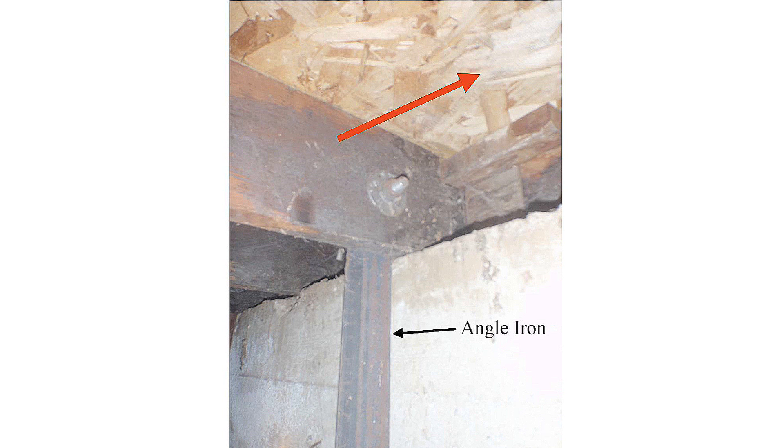This is what happens when the floor joist moves in the other direction. The nut and the washer on the bolt must restrain that movement. However, when that movement is restrained, it puts the floor joist into a condition known as cross-grain bending. Cross-grain bending causes wood to split very easily. Cross-grain bending is such a serious problem that the design manual that structural engineers use when designing retrofits highly discourages its use in retrofit designs.